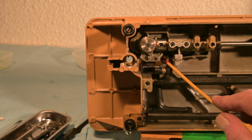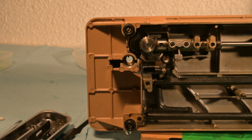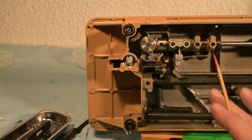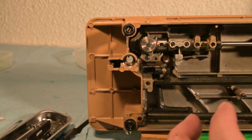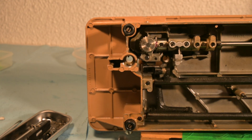And they look really different because that is the one where the nut goes on there. And that's where I do all the pressing with the lever to make the adjustment of the space on top. So that's what's going on there. So I'll leave that nut out because I'm going to need it. And when they go in there, it's more a case of just getting them started in the tube holes, and then just letting them hang. Because what's going to hold them in there is not them being pushed all the way in by me installing them. What's going to hold them in there is that rod after the nut is on.